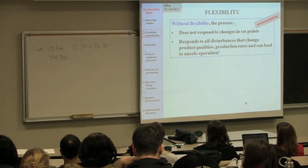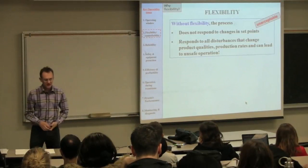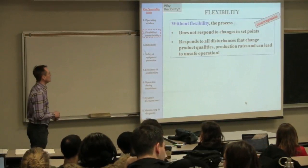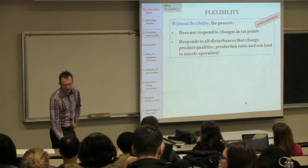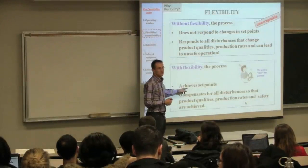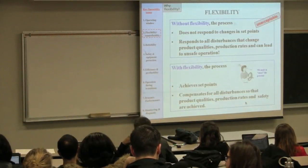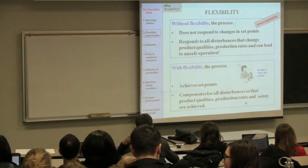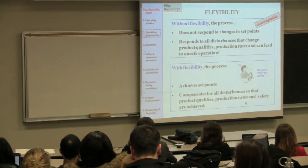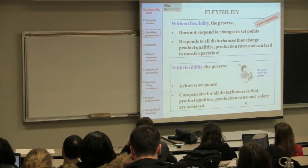Let's take a look at this topic — flexibility — on page 42 of your principles. Last class we looked at steady-state operation of the process and establishing operating units. Now we're talking about dynamic responses and whether we can tell how our plant will handle disturbances. We want to achieve set points and compensate for disturbances. Driving a car is a perfect example of feed-forward and feedback control — you compensate for what's coming ahead, and your gas pedal achieves a desired speed set point, which is exactly what cruise control does.